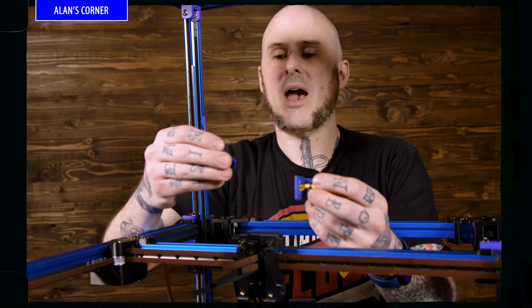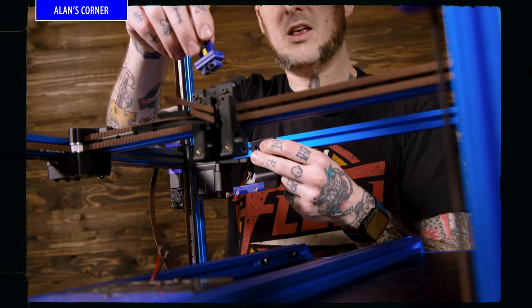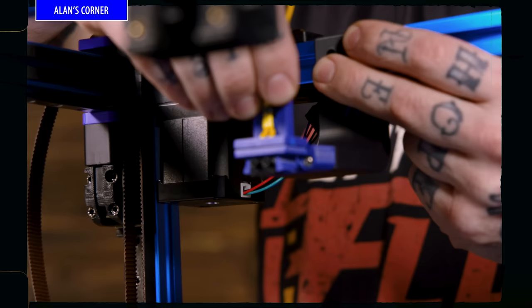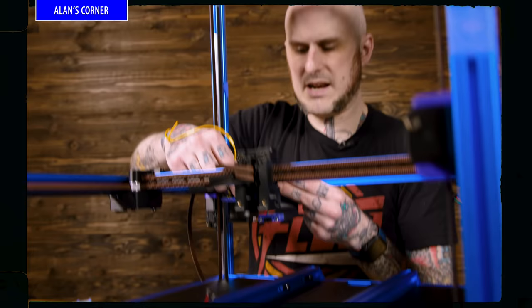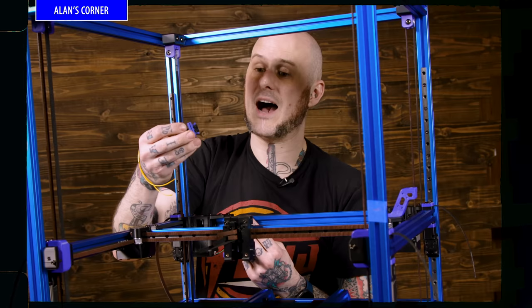And it doesn't have to be on the machine at all times. So you do the bed probe mesh and then it'll actually park. There's this little dock piece that mounts to this back extrusion here. There'll be pre-programmed coordinates for the tool head to come back to here and dock the switch into here, and then swipe it off the magnets. And now the switch is not attached to here, so we reduce the weight on the tool head while it's actually printing. This has also been shown to be very accurate, more accurate than a BL Touch or Pinda Probe. I've been intending to install one of these on my 2.4, but you're getting it before I am, so.